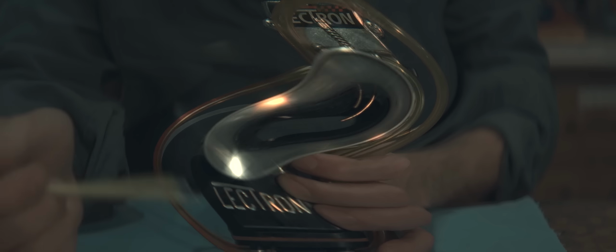Well, that step wasn't meant to be there at all. The only reason it's there is because I made this insert one piece for ease of installation and the gluing. After installing those inserts, I probably said something like, we need to grind out that bottom. But first, let's see how it behaves without grinding it out. See what happens. It's that compulsive, adventurous behavior coming back to bite me once again. Constant need for testing, and like, what kind of a positive outcome could you possibly expect from this? A huge turbulence-inducing step right in front of where fuel is supposed to be carried along by the flow.